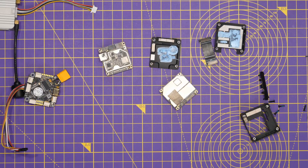There are connectors that have completely different wiring, and you could end up damaging the UARTs — meaning you've got no OSD — or even damage the power input. There wasn't a lot of information out there on what could actually be repaired on this air unit, so I decided to tear this one down and have a look if there are protection diodes on this air unit, just like on the other air unit and the Vista. Unfortunately, in the process I did end up damaging it, and I'm going to need to repair that along the way as well.